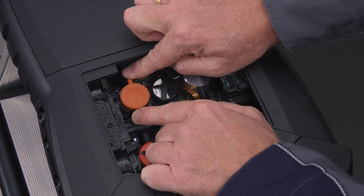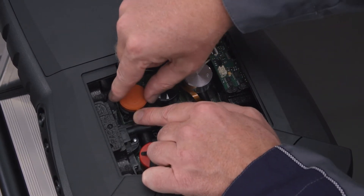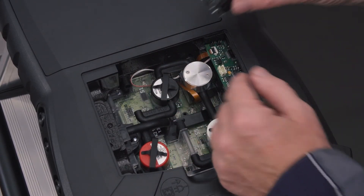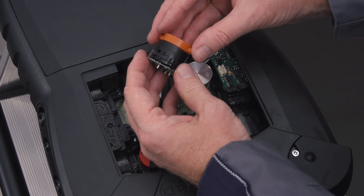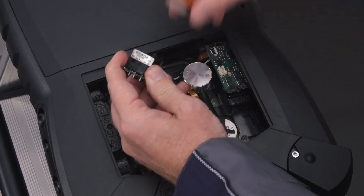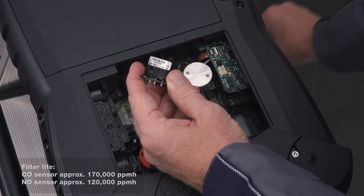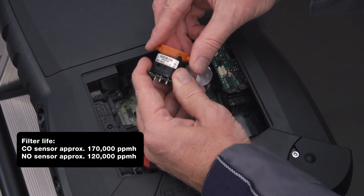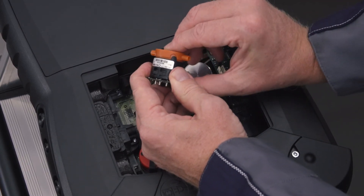The H2 compensated carbon monoxide and the nitrogen monoxide sensors are equipped with replaceable filters to neutralize cross gases. These can also be easily replaced by the user. To do this, the old filter is pulled off the removed sensor and the new filter is plugged on. When replacing the filter, it must be ensured that all markings match up and that the sensor electronics are not touched.